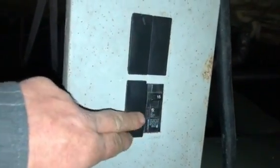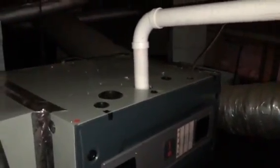Now we've got the S9 furnace, and you can see here where we had a double pole breaker that went to the air handler before. So we took that out and put a 15 in it and a blank off plate there, because I think they had two. They had one for heat strips and one for the air handler. So we put this wire in it, and I'm so sure we couldn't have added a hanger or two or a clamp or two on this. I may have them do that. But I do like the S9 furnace.